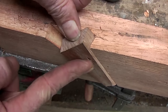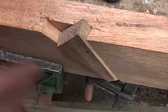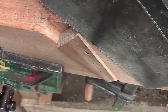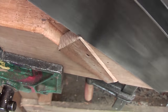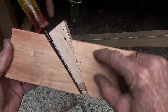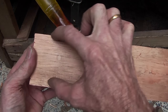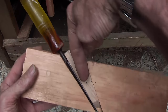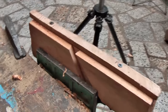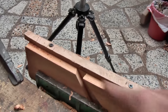One last thing to do is to put that wedge in there and we want it flush. If you have a plane you could just plane it off; if not, run the saw down it and slice it off that way. So there it is basically functional, but I think that block is a little bit too deep for the length of that blade, so I might reduce it a bit — top or bottom or both — just so that the chisel can go down a bit further. You can also screw a fence onto the bottom part of that just as a guide.